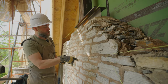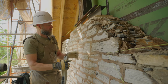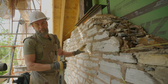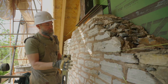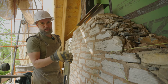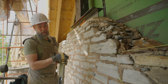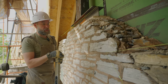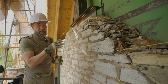After this is completed — hopefully mid next week — we'll get the stone laying done and then cut out the remaining joints. We've been removing the old cement mortar joints down the wall. Remember, this is not the original mortar — it was put in probably in the 1950s or '60s. It's a ribbon joint, a completely different type of mortar and joint profile from the 1820s construction. We're restoring it to the original joint profile, original color, and original material — using lime mortars from Saint Astier from France. The walls will breathe, so when the wall gets wet it can release moisture like a sponge back into the environment and won't trap moisture inside, which could cause beams to rot and other issues.